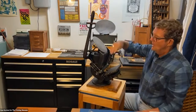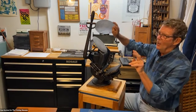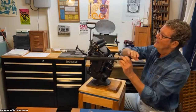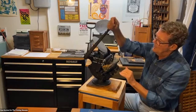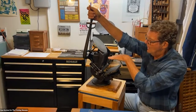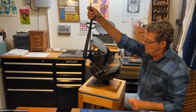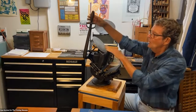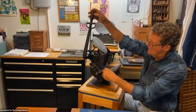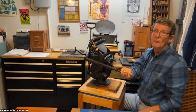But as you can see, we have to ink it. And it was a big deal when they were first invented, self-inking. The rollers come up here, get some ink, spread it out nicely, and then ink the type. So for every impression that's made, the type gets 2 passes of the rollers. So inking with rollers is the number 2 action. You've got to move these rollers down beyond the frame, all the way up into the little disc reservoir.